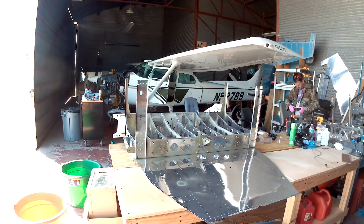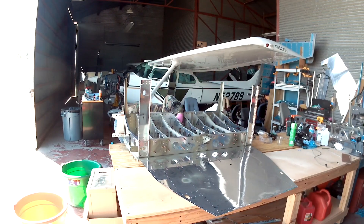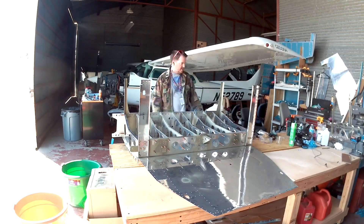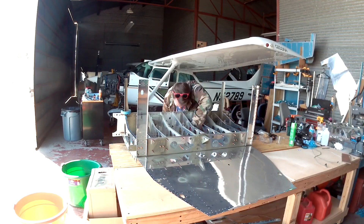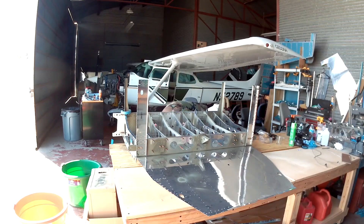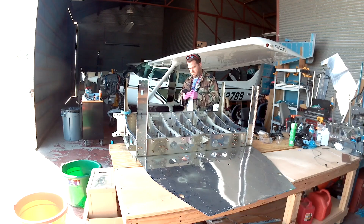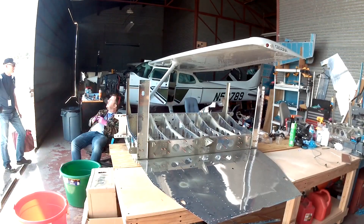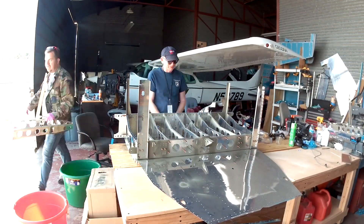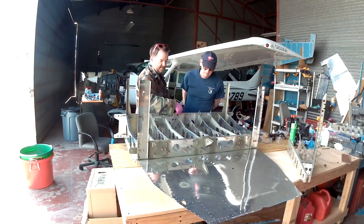This is an official point — the fuselage is now too bulky and a pain to move by myself. I need aid. What I'm doing right here is riveting the middle five rivets of the back bulkhead — well, the back wing box bulkhead, the main bulkhead. You don't rivet everything right now, you just rivet five rivets in the front and center, which I've done, and then you rivet all the ribs. I was able to do the five center ones, and now my friend Ted is here and we are going to rivet this thing up.